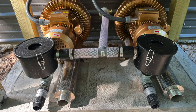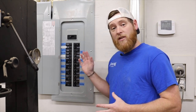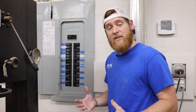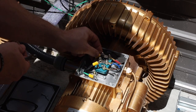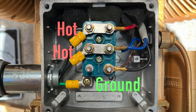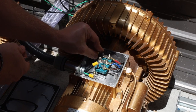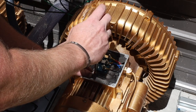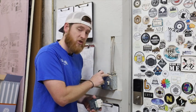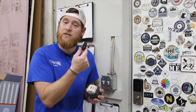Here's what a completed installation in parallel looks like with these vacuum pumps. Phantom recommends that you have a licensed electrician help you wire up your CNC and vacuum pumps to the electrical panel. If you have a working knowledge of electricity and understand the safety concerns, you can do this yourself. Each pump will need its own 220-volt, 30-amp breaker and 10-gauge wire. You will need a three-wire electrical run — two hots and a ground for 220V. If mounting these pumps outside, it's best to add an outdoor disconnect. The two hot wires will be mounted to the screws on the left side of the box that have connection bars on them, and your ground wire will be mounted to the junction box housing. My suggestion is to put the pumps on a switch with a contactor, or wire them up to a wireless remote — these wireless remotes are only $24. I did a full YouTube video on this on my personal channel.